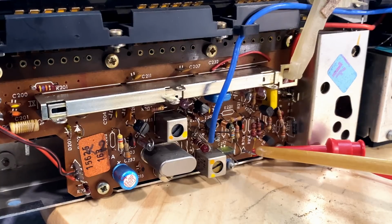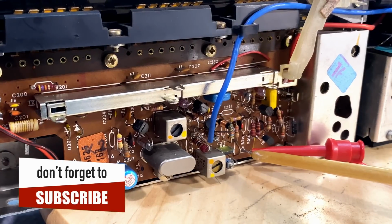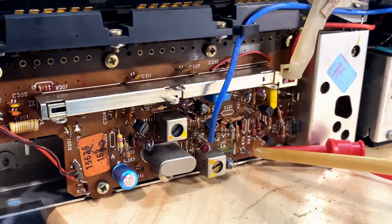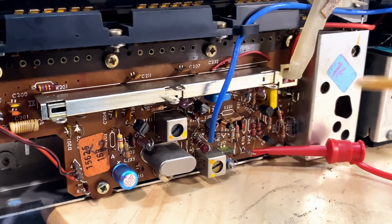And they do tell us to measure at the output meter, so they're actually telling us to measure at the audio output. So if we feed a signal in here at 2 megahertz with an audio tone modulated on it, and it meets this mixer, then whatever frequency you adjust this mixer to, it will either allow the 460 to go through or not. In other words, you have to adjust this mixer so that this signal coming in here mixes and gets through at a difference of 460.